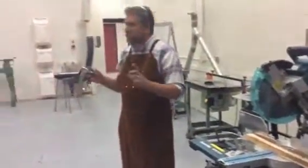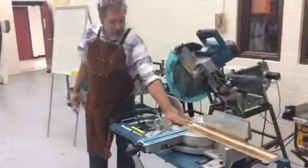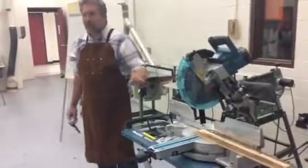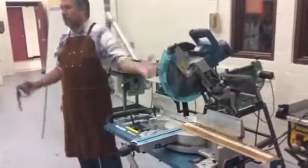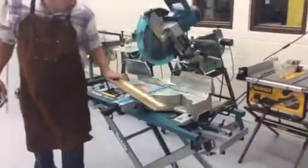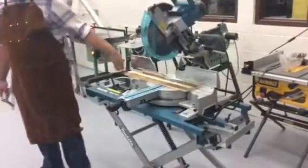If you're cutting small pieces, you should make sure you're cutting a good distance of material. These saws aren't really meant for cutting off just a little inch at a time. Yes, you can do it, but you do add risk when cutting shorter amounts of wood, because you have no way of controlling it. There's essentially a no-hands zone there — you want something that's relatively stable.